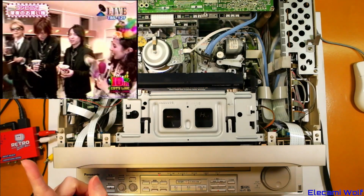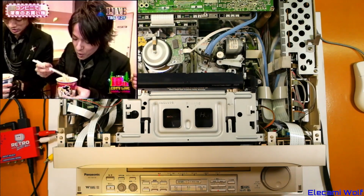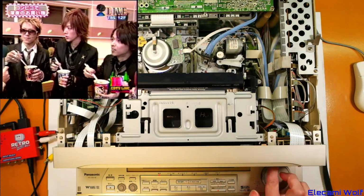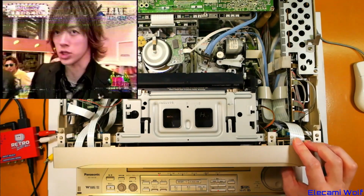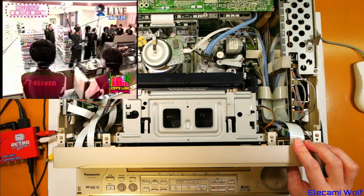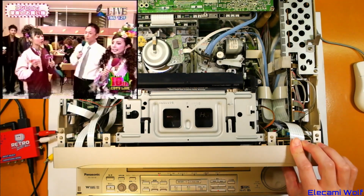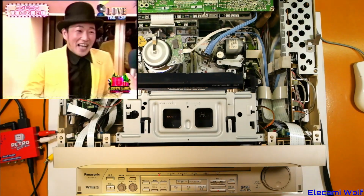This thing does have a bit of trouble with tracking. You see there, it's establishing the tracking, but it's drifting a bit. The alignment might be a bit out. So you can push the two buttons in here, they're plus and minus buttons, and it will go into manual tracking mode, which you can then push the buttons to... Yeah, I think it's at one extent on this tape. About there. I don't think there's any display of how close to the edges you are with the tracking. Put it back on auto. There's AT on the screen when you do that. And it's auto.